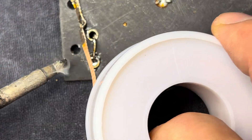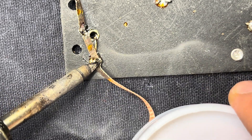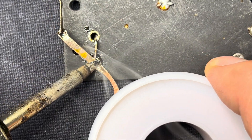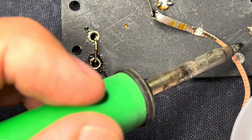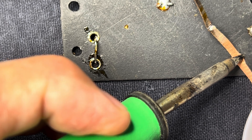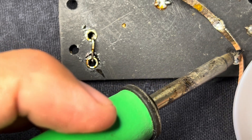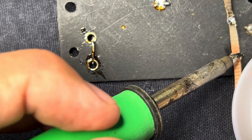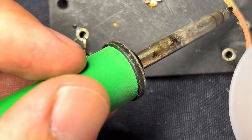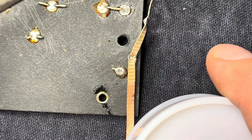I'm gonna stick it right there in a corner. These all gotta go. So the rectifier on the bias supply shorted, and then it pulled excess current through that F&T, just split it wide open. We're not gonna leave anything to chance — this is not in a signal path, this is not about tone. This is about reliability, so you gotta go, buddy.